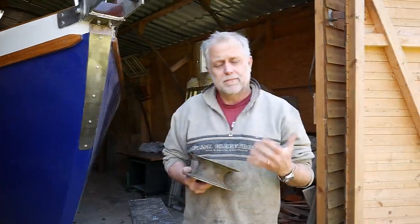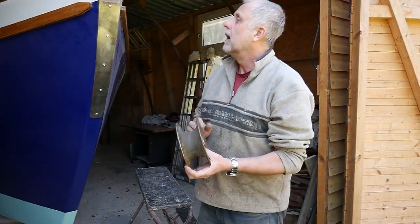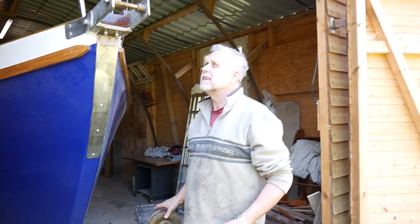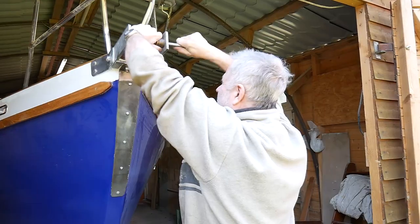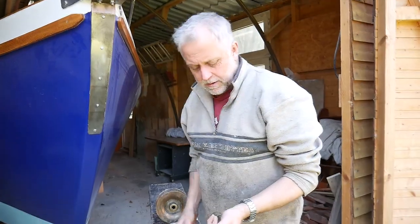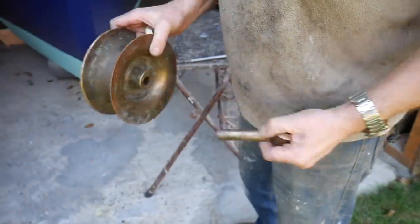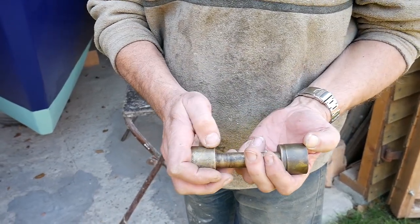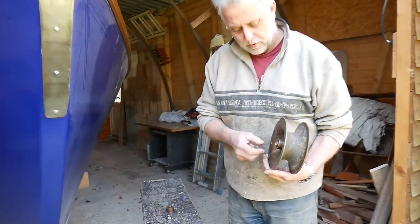And great little tool. We've got roofers in next door, so you might hear that. We've got this lovely bronze bell roller that we had on Miss Molly, actually, and had to adapt it a little bit to fit it into these stainless cheek pieces there, the bell fit in there. And all I've done is made up these pieces. The bell roller runs on this bronze roller, slides in there obviously, and then two cheek pieces machined to size either side of it, so it's got a little gap there, a little bit of play, it all fits up in position, and all in bronze.